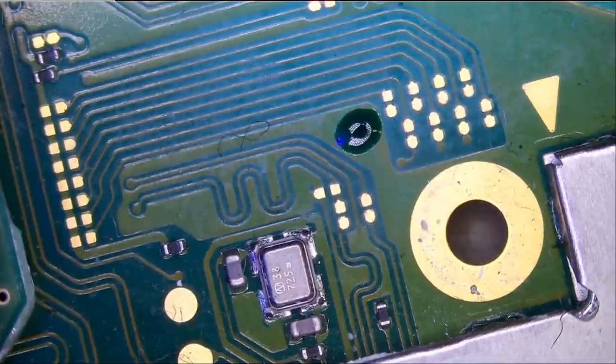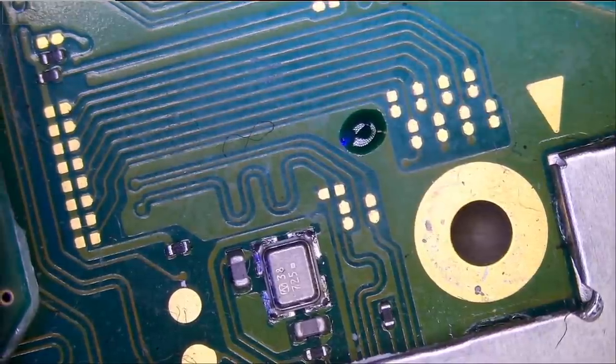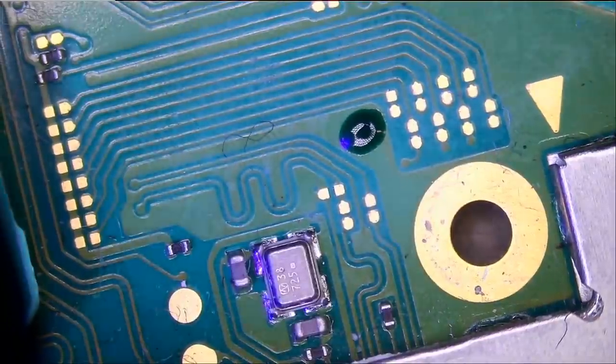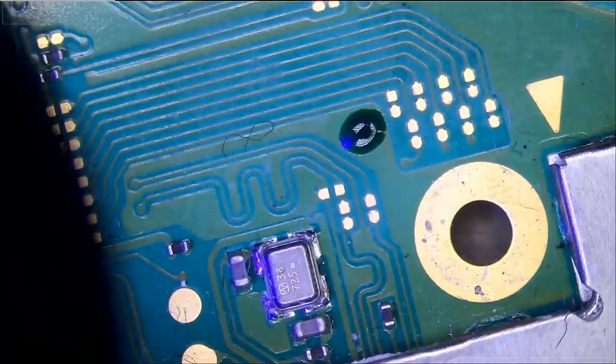And that's why sometimes when you are applying solder mask, you wanna spread that solder mask. You do not want to apply a lot because the more you apply, the longer it will take for that blob to harden. So I'm gonna keep my UV light for maybe 15, 20 seconds and see what happens.